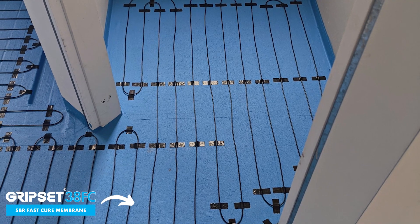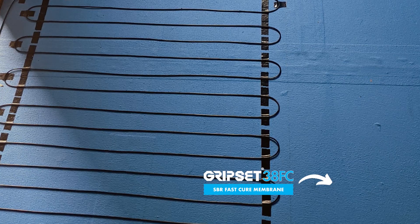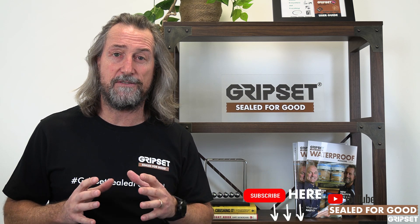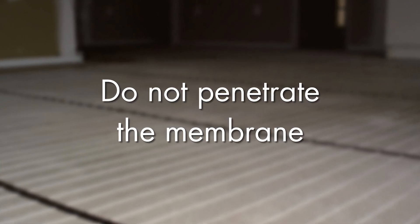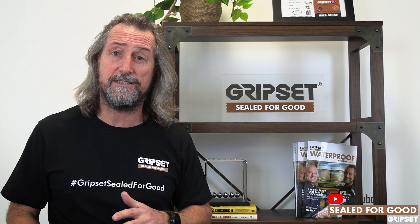Then if you are the tiler putting the underfloor heating on, or there's someone coming in afterwards, ensure that the underfloor heating system has been checked with the manufacturer on the installation details. Sometimes you might have seen a program on TV where they show one person stapling it down, another putting tape, and others with silicone. Make sure the system is installed per the manufacturer's details and, more importantly, it cannot penetrate the membrane. Staples are a no-no, but tape is a frequent one that's used, or sometimes sealants, or sometimes even slurry adhesives with mesh that can bond the underfloor heating system down.